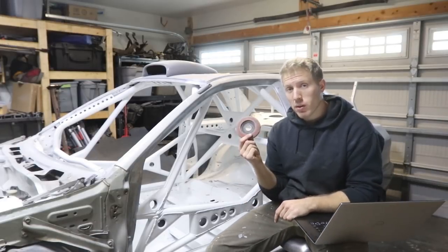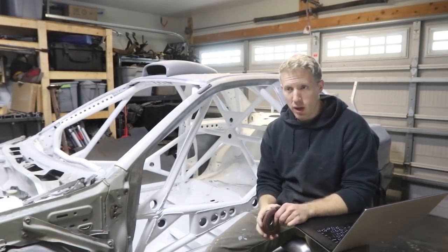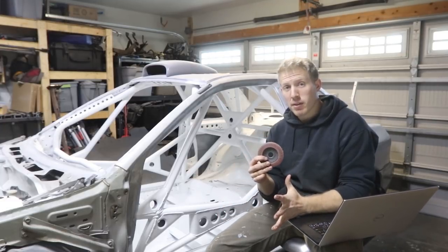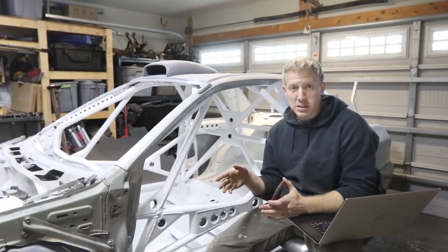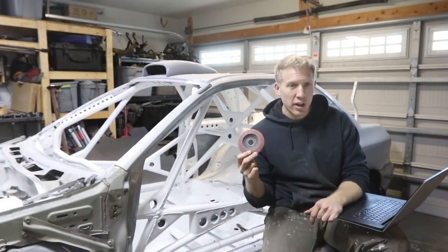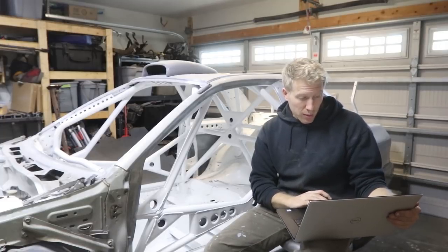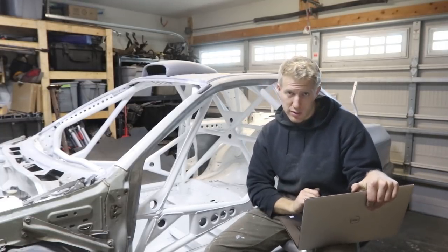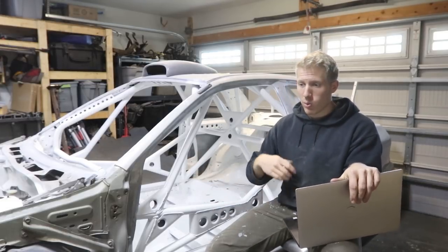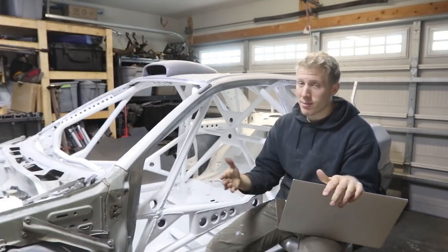I still had to buy quite a few flap discs to clean up cope joints, get them to fit well, and get rid of any lips and sharp edges — especially if you're going to be notching by hand. I bought a cheap 10-pack off Amazon, $20 for 10 at 60 grit, and they lasted a really long time. I still have brand new ones I haven't touched.